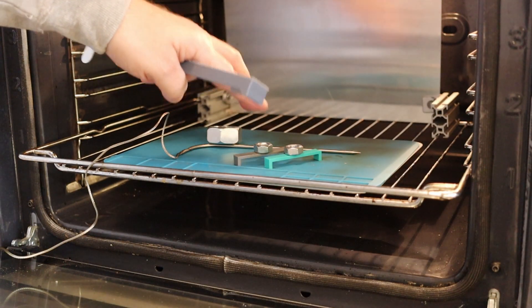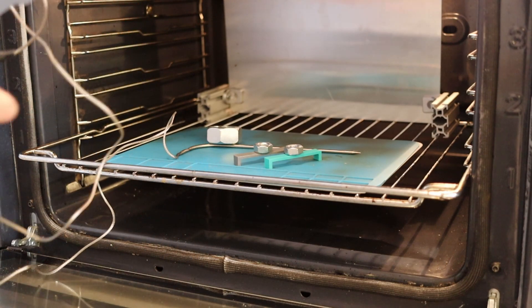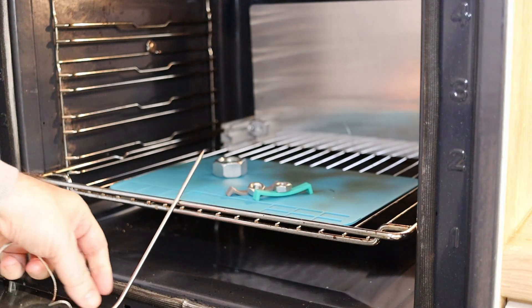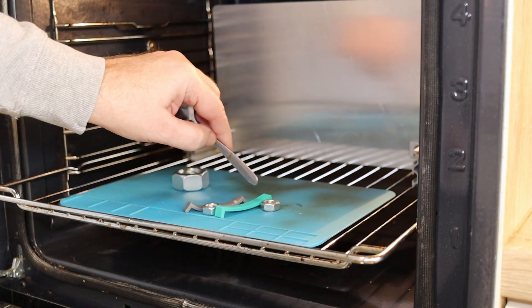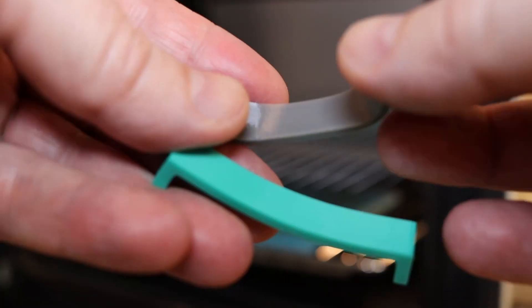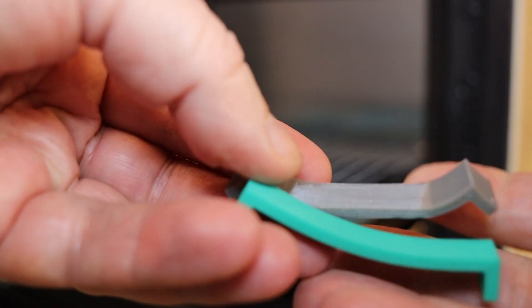The temperature test records the temperature of first deformation, tracked with a cooking thermometer. No surprises here: PLA started deforming around 53°C and PETG around 70°C. But then PLA actually stopped deforming, and in this test almost performed better than the PETG. After one minute the PETG is still very soft, but PLA+ is quite hard — though the start-of-deformation temperature is still the most important value.